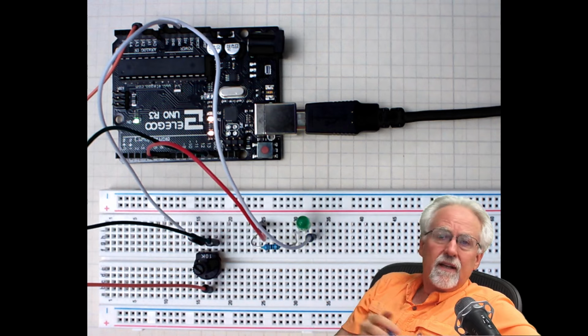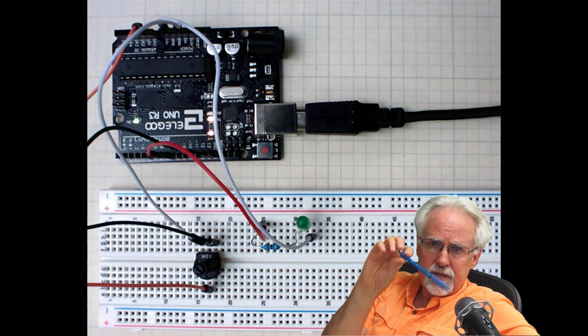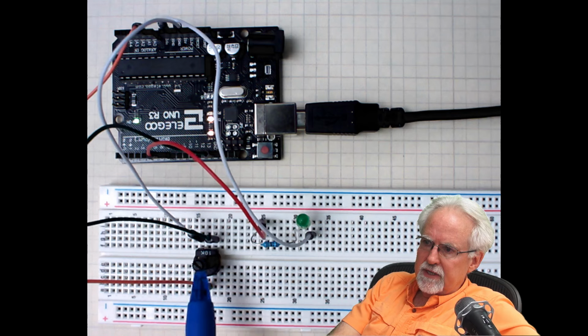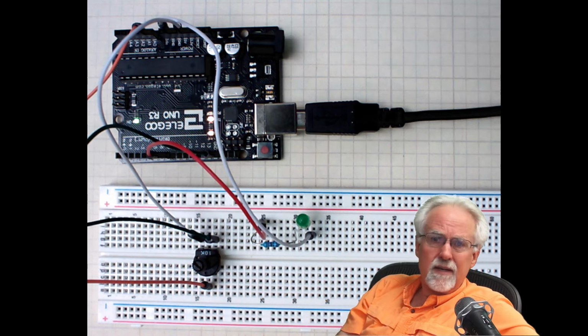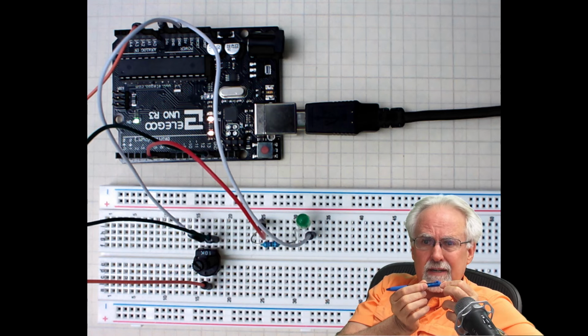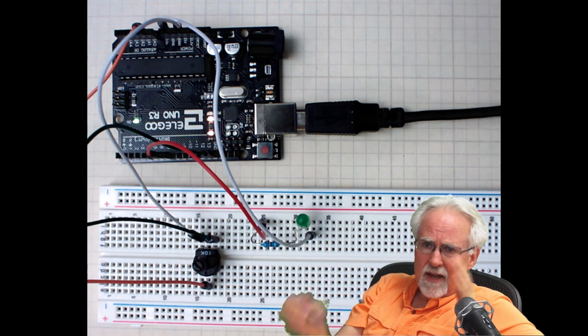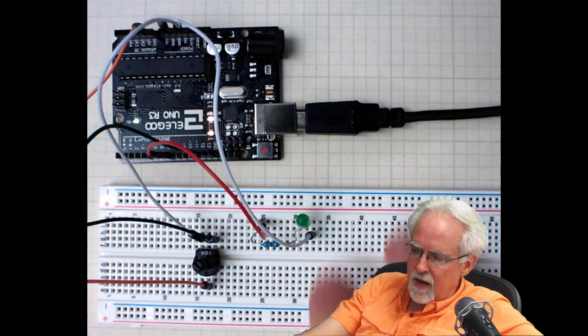But to write to the LED with an analog write, we need to write a value between 0 and what? 255. So if you just read the potentiometer value 0 to 1023, and you write that to the LED, it's not going to work, because you're going to very quickly get to 255 and you've pegged it out. And then you're going to write values above 255, and then the analog write isn't going to work. The whole thing is going to mess up.